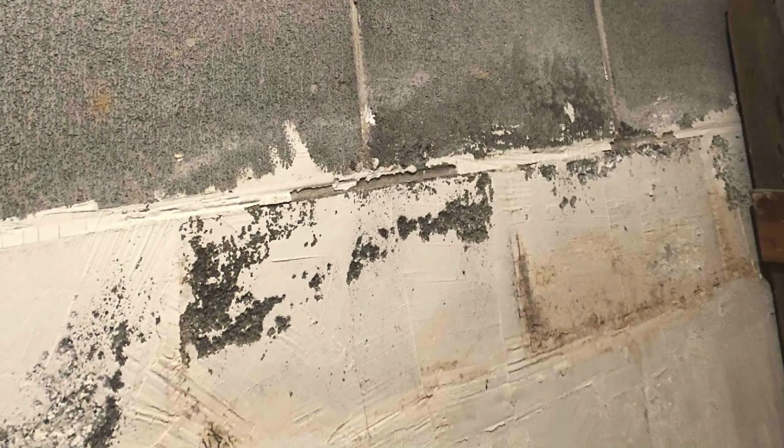Once that water punches through that sealant, no matter what the waterproofing paint is, that waterproofing paint has just lost its integrity. Once it's lost its integrity, remember those waterproofing paints are typically not mold proof. They may have a little bit of mold resistance to them, but for the most part, they can grow mold, especially after a long period of time of moisture and different exposures like that. Even humidity can cause some of them to grow mold if they don't have some kind of mold resistance built into them, and most of them don't.